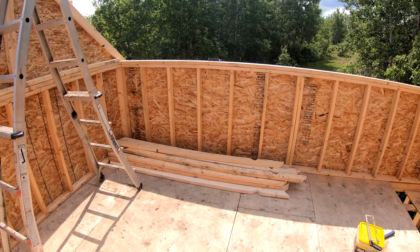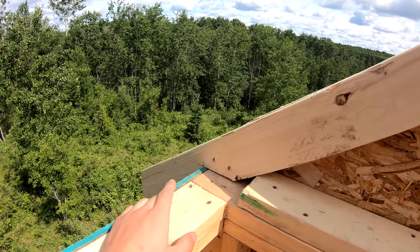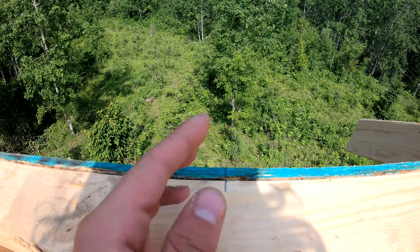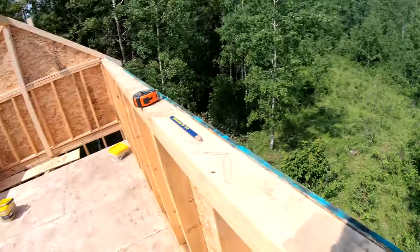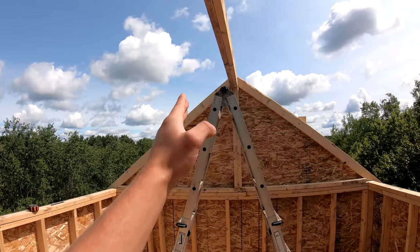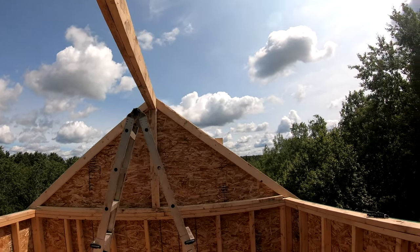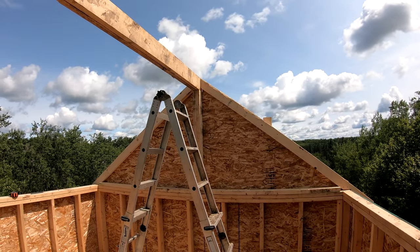Got all my rafters piled up, ready to go, and we'll just start laying them 16 on center. To mark 16 on center: you measure from the outside of the board, develop a mark at 16 inches, and then you put the board on this side of that mark so the edge of that board lines right up with the mark. I did the same up there. I'll go back and forth — one on this side, one on that side — so I don't develop any warps in that ridge board. Rotating them makes physical sense.